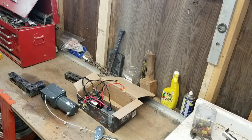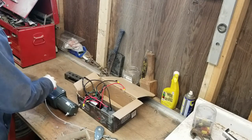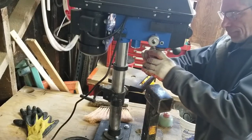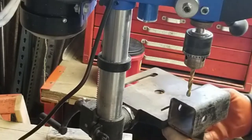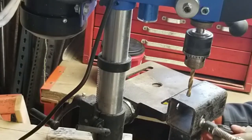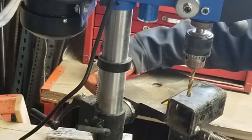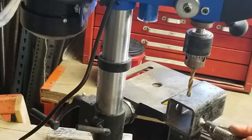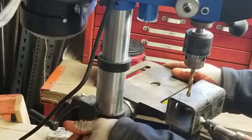First things first, we're gonna find the drill bit. I want it basically the same size as that hole. Yeah, this one — perfect. I want to actually clamp this to the table just for rigidity's sake. You want everything to be safe, so clamping it and stopping everything from moving is the best bet. You want to clamp it almost directly underneath where the pressure is going to be.